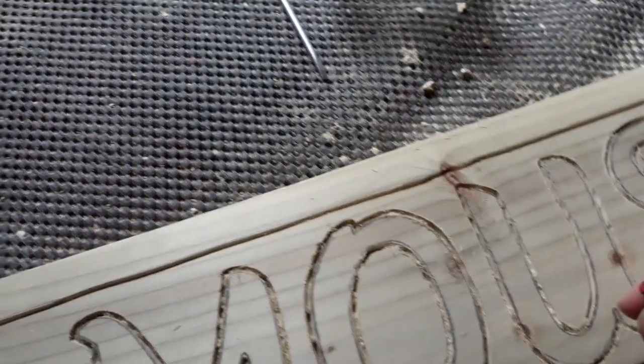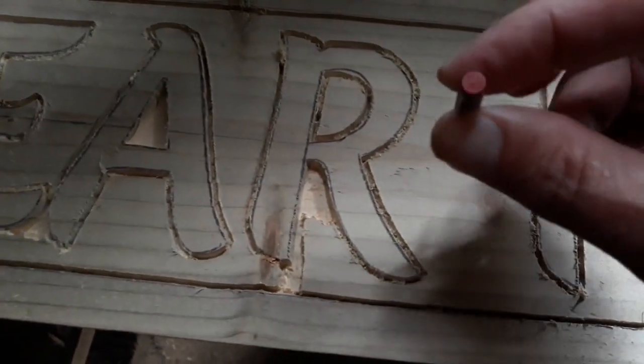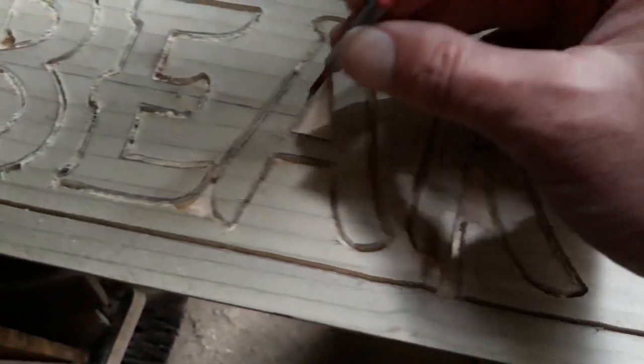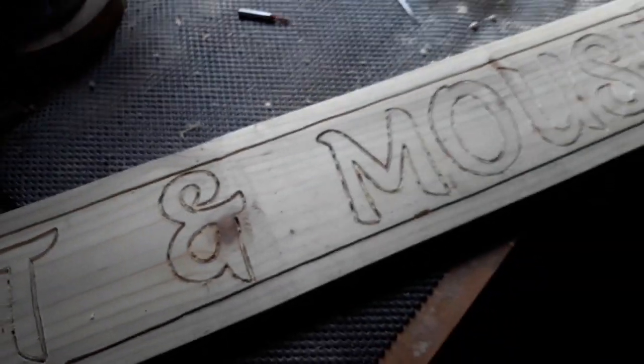If we find out it's coming out too quick and it's ripping the back of the board in, if I can just find your piece somewhere, there's a letter A here, and it's just maybe not as smooth as it should be, then we'll go back to the end milling bits. So we'll pop this piece in a router. It's a 1/4 inch shaft on it, so we don't need an adapter collet for this one. We'll set it to that depth there, and then we'll start removing all this background, and there's plenty of it.